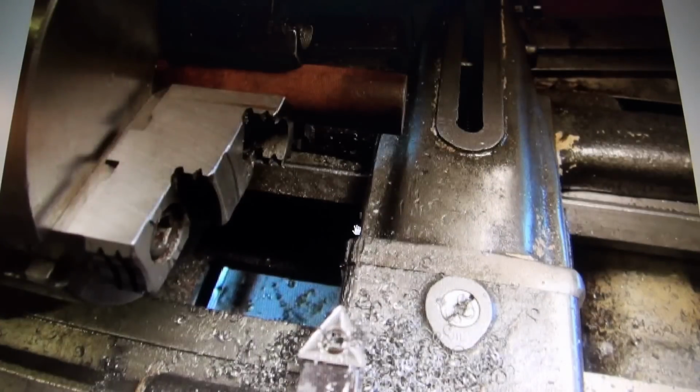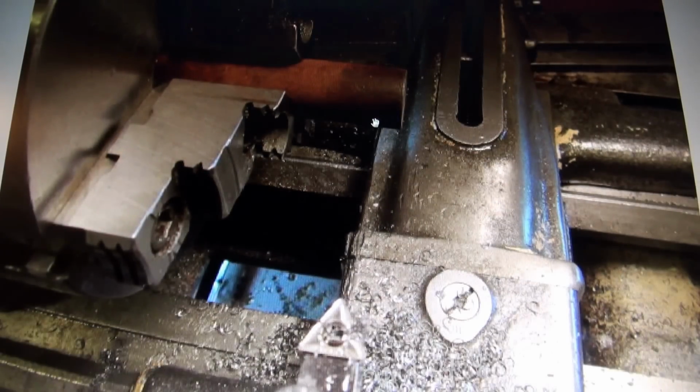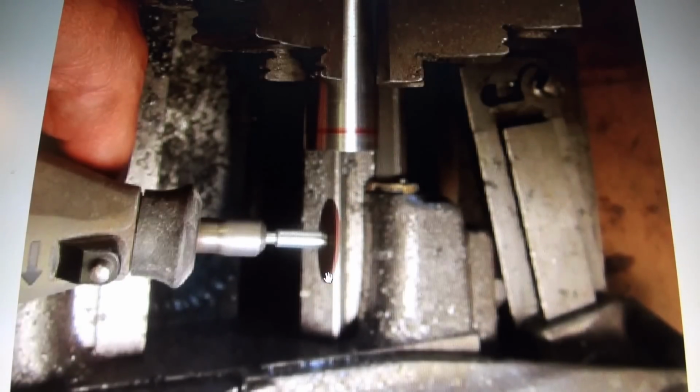And so here my idea for the next phase was to take some steel. I better back up there. Some nice steel here. And what are we doing here? Well, I'll show you that part later. But right here's the actual piston sleeve. Now we are cutting the notches in for the bottom of this piston sleeve because you know how these things are. The spring has to sit on the bent over piece of the piston sleeve to keep it from coming out of the piston.